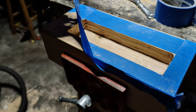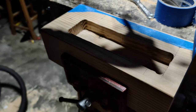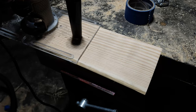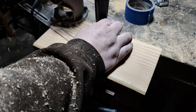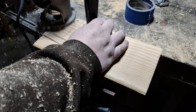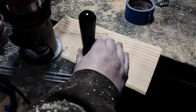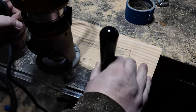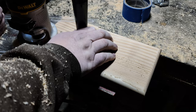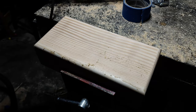I don't have a lot of good video of me doing this because most of it is just close-ups of my hand, so I'll skip over that. The tape helped keep the lines a little cleaner, so I peeled that tape off. Then I used the round-over bit on the trim router to round over all of the edges on these things, since these are in theory for kids to play with. I thought getting rid of all the sharp edges would be nice — a nice little half-inch round-over, something like that. Anyway, it's pretty round.